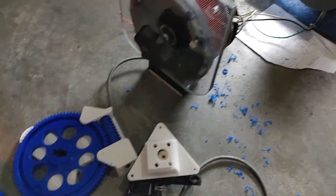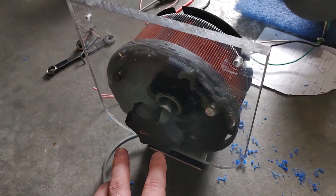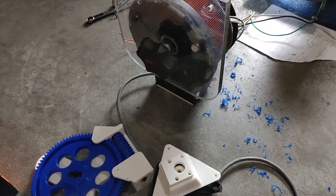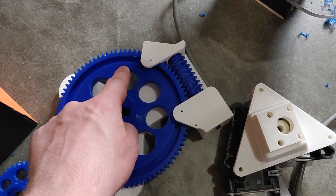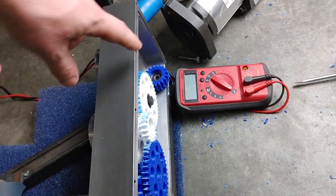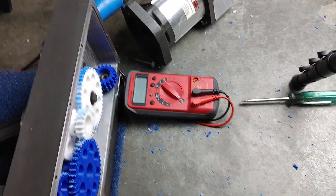For each test I want it to be consistent. I've got this little geared motor which is going to couple to this, and then this gear couples to the Variac. Once it's at a set speed, I'm hoping it'll turn up from 0 to 146 volts in about two minutes, and there are going to be some micro switches on here with stops so I always hit the maximum speed every time. I'm also going to put a revolution counter on the very last gear, and whichever gear achieves the most revolutions will be the best set.